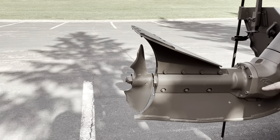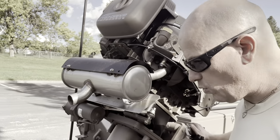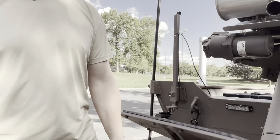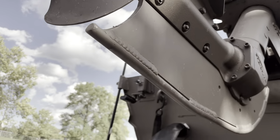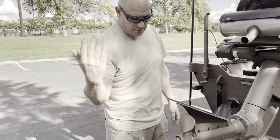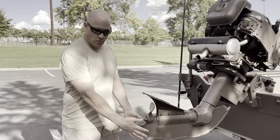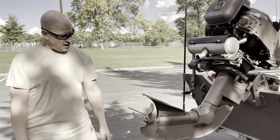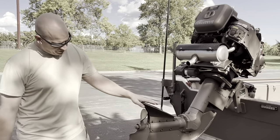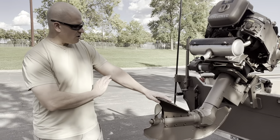What makes this motor unique is that it's gear driven — most mud motors are belt driven, but this is gear driven, with a gear set right in here. This particular motor runs off a series of additional hydraulic pumps all made by Parker. You can see the skeg — these things are designed to hit things. As you're cruising along and you hit a stump, it'll pull this motor back up out of the water and slam right back in — that's what these are built to do. They also have a rock guard available for rocky rivers. The way these things are designed, they're built to hit things. That's why the aluminum is so thick and the welds are just spotless.